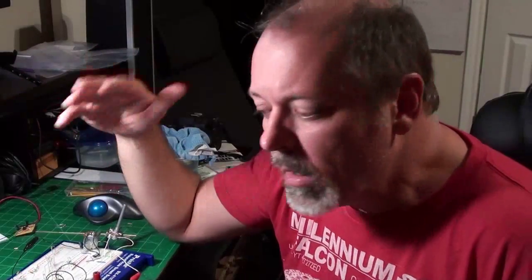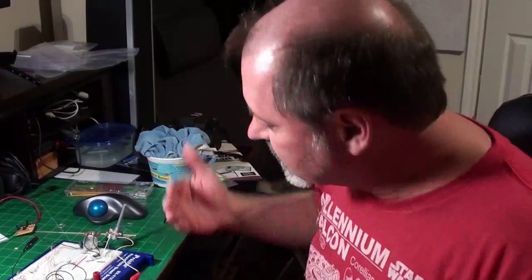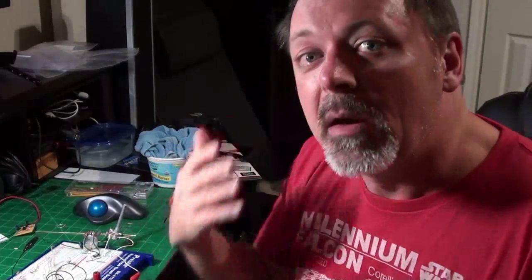I know my lighting videos are missing a few things — I haven't done any lighting plans, like sitting down with the model and deciding where lights go and what voltage to use. I'm going to do that with the Millennium Falcon and the A-wings. The A-wings are going to get a 4060 timing chip, primarily because the small ones will be powered by a 9-volt battery and the 4060 won't drain it — I'm only going to have about four or five LEDs total.